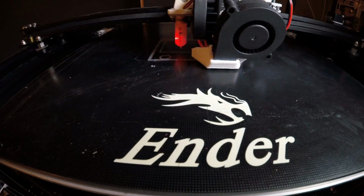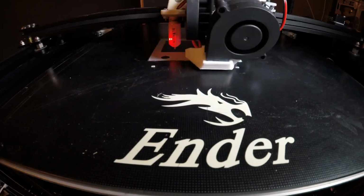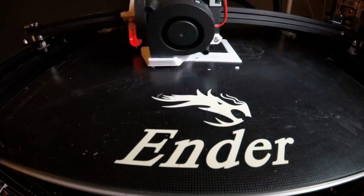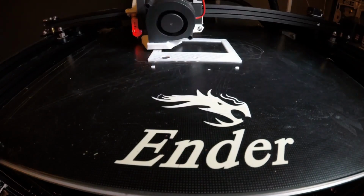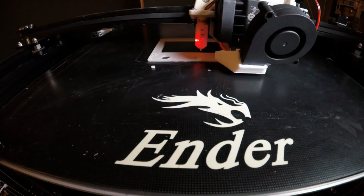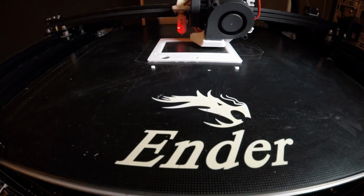Upgrading the hot end reduces the risk of blockage issues and heat creep that standard blocks suffer with. In addition, the 32-bit board and trinamic stepper drivers not only reduce noise, but also should improve the calculation of the curves and arcs, acceleration, print quality, and of course there is room to grow and escape the basic boards from the manufacturers that don't allow board mods.